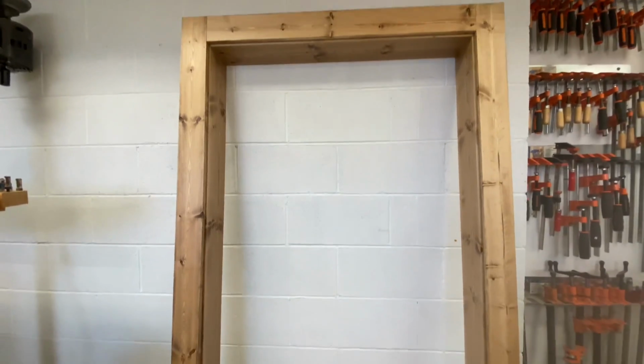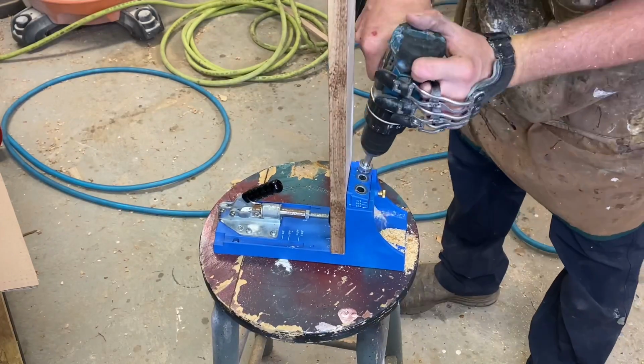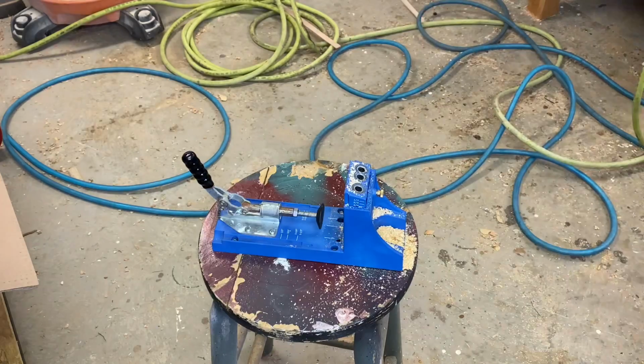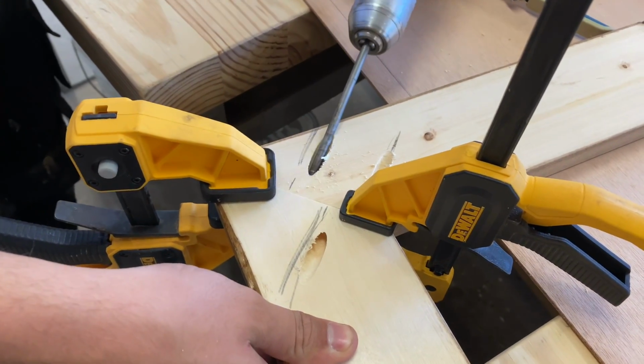And just for you, Jamie, I'm going to show everybody how you built these things in the shop. With the measurements that Jamie took from the job, he pre-cut all of the face trim boards and pre-drilled holes in the back with this Kreg jig to actually pocket screw the face frames together. Then the face frames were aligned using clamps and they were pocket screwed together.